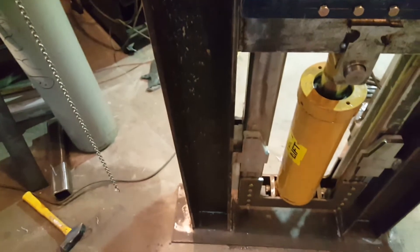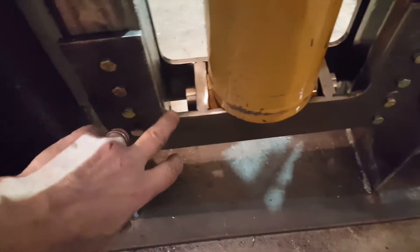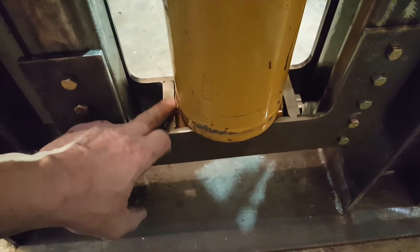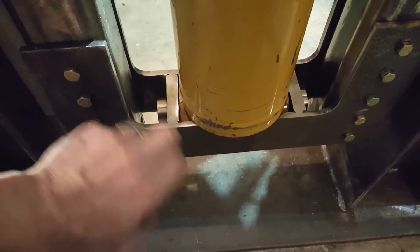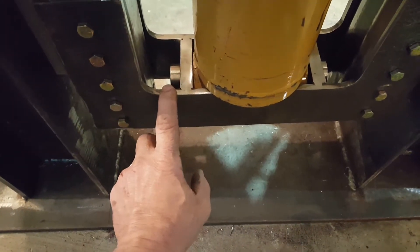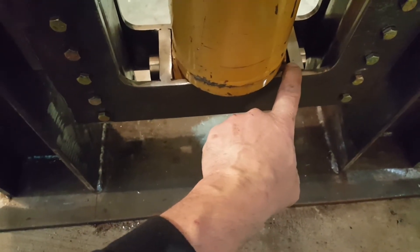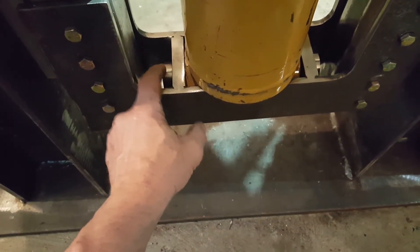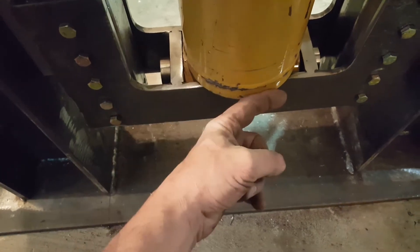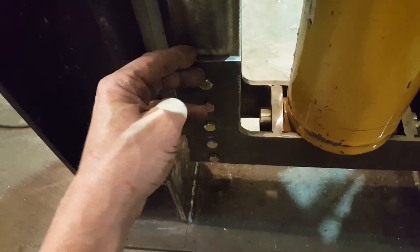The uprights are mostly guides for the design I came up with. Starting from the bottom and fabricating up: the carriage — the bottom of my cylinder has an inch-and-a-half pin, and the shoulders are pretty flat, so those shoulders sit on top of this ballistic steel. Then I have these half-inch cross pieces welded in with that inch-and-a-half pin going through the bottom.